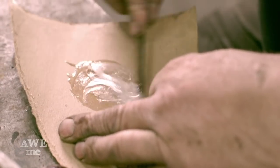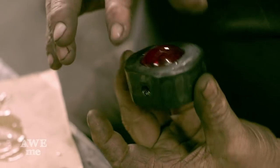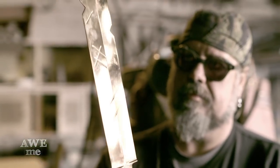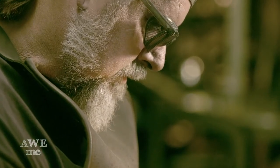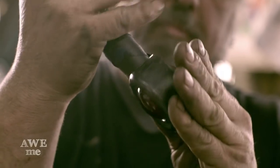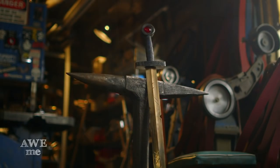I'm mixing a 5-minute epoxy to glue the gemstones in the pommel. The gold color on the blade is determined by the tempering temperature — I've had it in the oven at 385 degrees for 5 hours, and that caused the blade to turn gold. I give it the notches and scratches on the blade, finish up the details on the edge with the belt grinder, all pieces are together, and the Adventure Time Sword is complete.